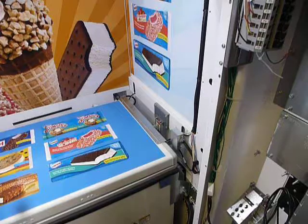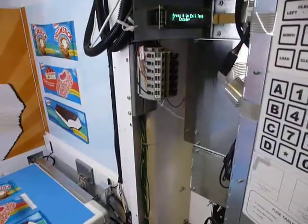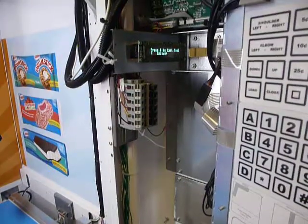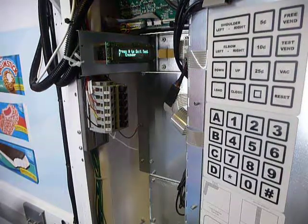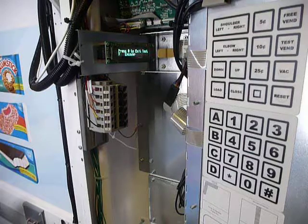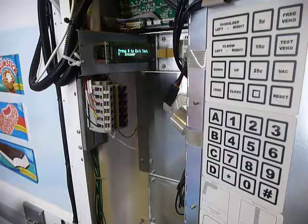Now, also in this menu, you can activate any of your motors, but you need to be careful, because all of the safeties that are on when the machine is operating in its normal state are removed here, and it allows you to operate one motor at a time. The motor will make short moves when you push a button.